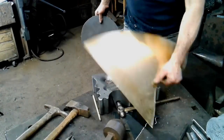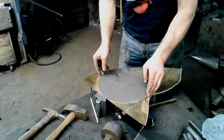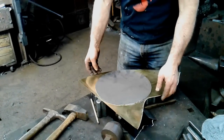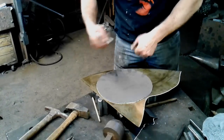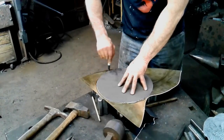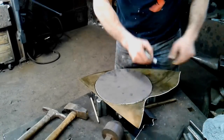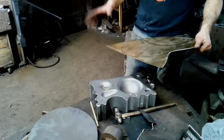I'm going to be making it out of brass. I've got a piece of 18-gauge brass sheet here, and I've got a circle which is approximately the right size — a little bit bigger than what the finish shape is — so I'm going to use that as my cutout. Now I go to my Beverly Shear and shear that out.